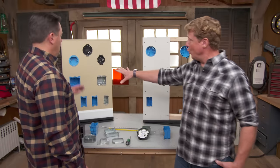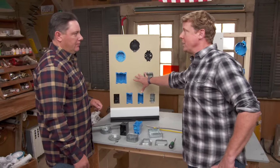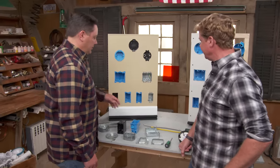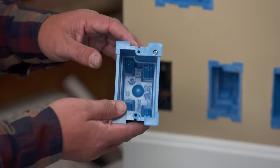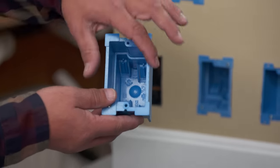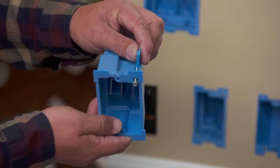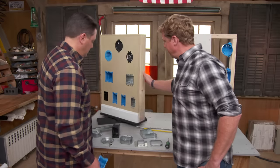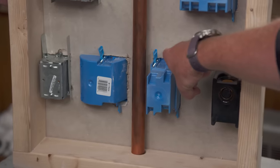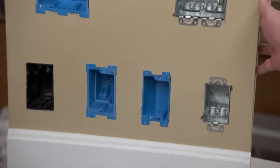So if that's new work, this is old work. We've got an existing wall, and we're either going back into a hole where a box was, or we've got to pop a new hole in — we're looking to add something. This is one of our more common boxes for old work: a single-gang plastic old work box. You'd mark the outside of this box, cut the drywall, slide it into place, and then tighten those screws and draw that clamp forward to hold it in. It's got a little bit of a flange there. And there is no stud that you're going into, so you could put this anywhere in the wall — right in the middle of a bay is fine.